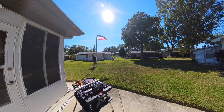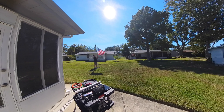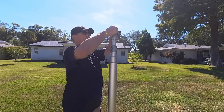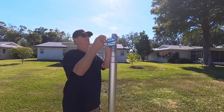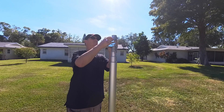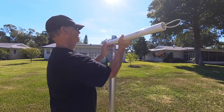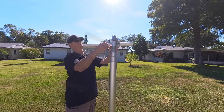Let's take down the 30-foot wire — the station reference antenna attached to a CHA Hybrid Mini — going up to that PortaMast. Once the PortaMast is quickly and completely collapsed, we'll attach this crossmember to it. I attached the nuts to the U-bolts in the shack so I wouldn't drop any hardware, but that failed — you'll see me looking down trying to find a tiny nut. I'm only hand-tightening here because I didn't use the topper on the PortaMast; this is a temporary setup for testing.